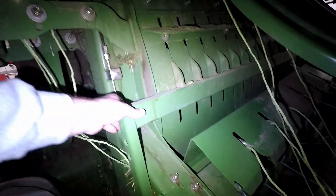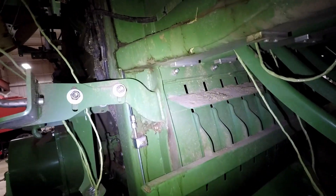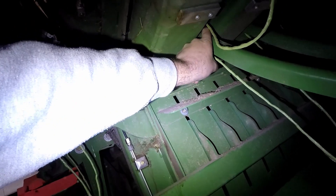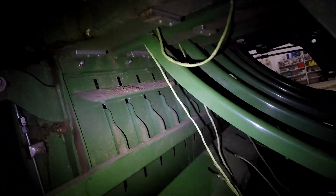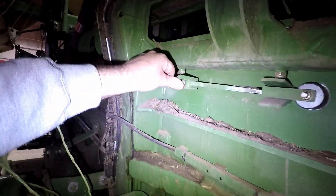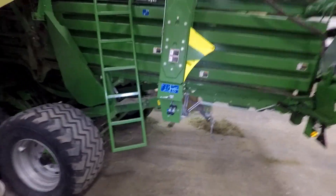This bar is going to basically let our hay go up in our pre-compression chamber, up into our chamber, so we have an even flake. These are our twine arms — they're tied to this bar right here. They're just going to literally deliver the twine. This one's actually frozen. They've got bearings up on top right there — there's a bearing on the top and it's actually frozen, so that could be a potential problem. We've got spring tension on our twines for slacker arms.